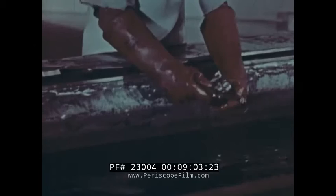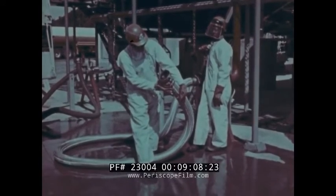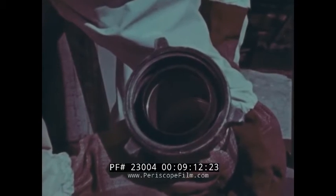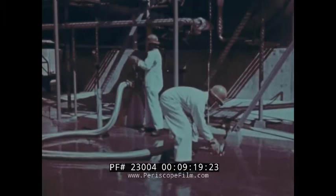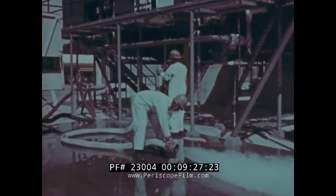All equipment used in the transfer will have been cleaned with a proper solvent to remove any grease, oil, or other organic materials. All hose adapters, couplings, pressure buildup coils, and check valves must still be carefully inspected for foreign particles. Then, if the equipment is clean and if the LOX is on specification and free of contaminants, the transfer hose is purged with a small amount of LOX and the first transfer can continue.